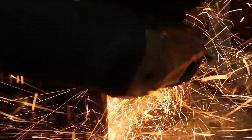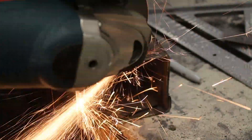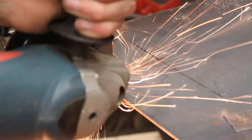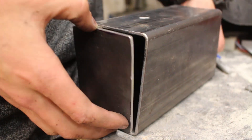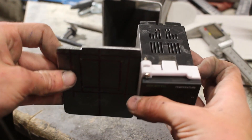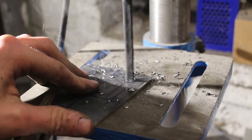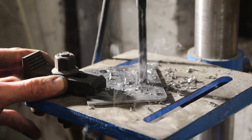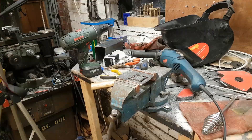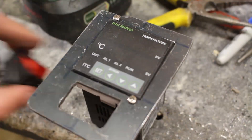I cut the front piece at a bit of an angle — I think it was maybe 15 degrees — because I want it to be slightly tilted up on the electronics screen since most of the time you're going to be standing above the oven. I then cut out a rectangle of 4mm sheet steel and filed it and ground it down so that it would fit snugly inside the door of the new rectangular enclosure. I drilled some holes using my drill press to help me cut out that square hole which is going to be a window that the screen of the PID controller fits inside. After a bit of filing and die grinding it fits on like this and then M3 bolts secure it in place.